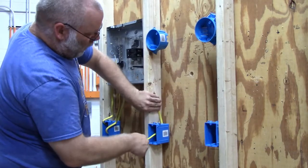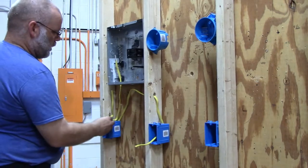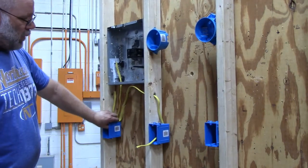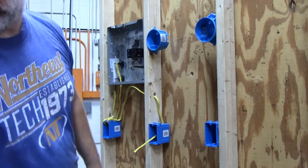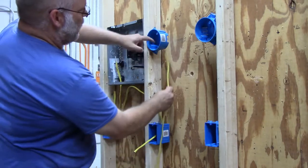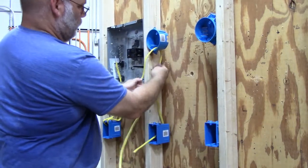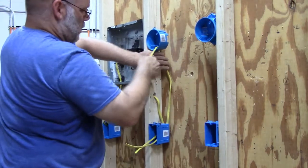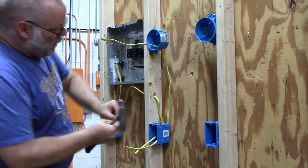I like to put the power wire next to the switch, and I like to put the hot wire next to the stud all the time. At this outlet it doesn't matter because they're both going to be hot — this one's power in and this one would be power out, into the switch box. Then the last thing I need is a wire running from this switch box into my light box. Put the switch leg in the outer hole and tack these down.